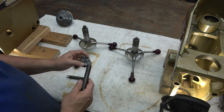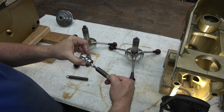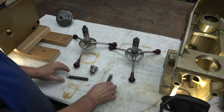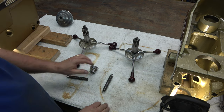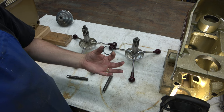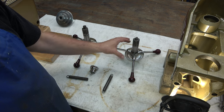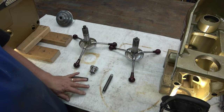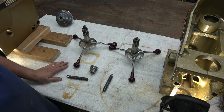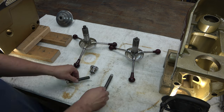You can't use a double loop spring with the old knob — it won't fit between the two protrusions, so you have to have the dog leg. The channel for the lock screw on the pinion was omitted, and a fiber washer was included that helped to separate the hub from the head casting. Otherwise, they are exactly the same — same length on all the parts, same type of knobs, rods, everything.